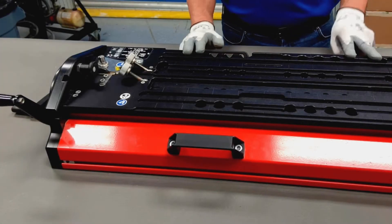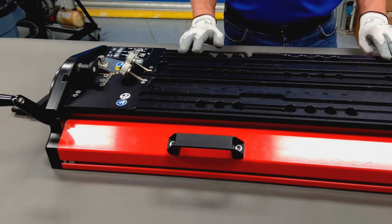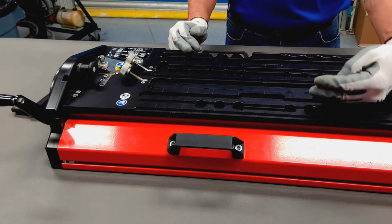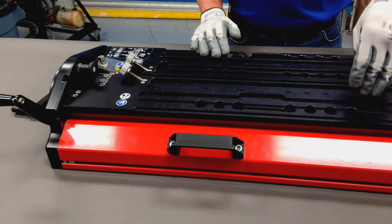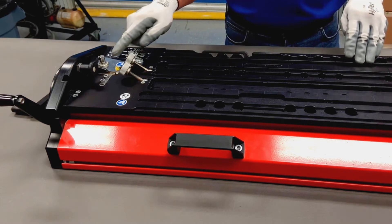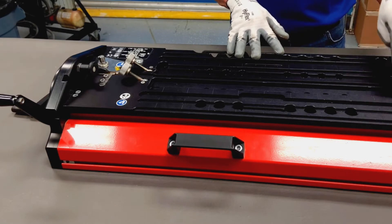We're going to talk about aligning the platens on your Amigo. Whenever the fixed platen is removed, it will have to be brought back into alignment with the back platen. To confirm that it's in alignment, we'll have to check alignment first on the back platen. We can use the blade holder as a spacer to align the fixed platen, or front platen, with the back platen.